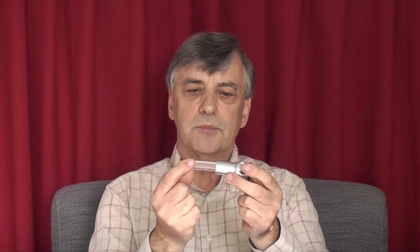Because the diameter of the rod I was using was 15mm, which I reduced to 10mm, I had problems seeing through the rod to see where the centre finder was, and that's why I drilled these holes in the side to get more light in. But at the end of the day, it wasn't good enough, so I bored out the bore to 15mm, and I'm now using a 15mm perspex rod that fits the bore. And I've also had to make a new centre punch that's 15mm.